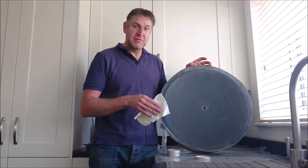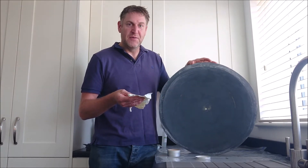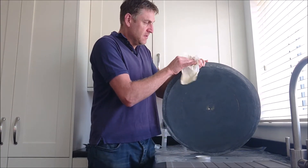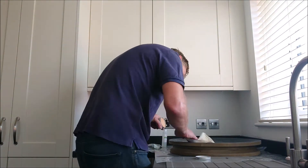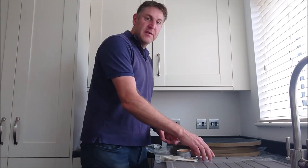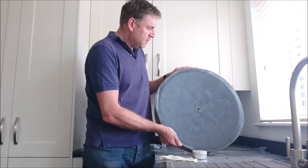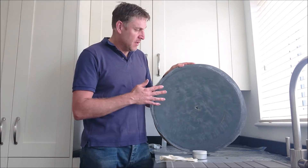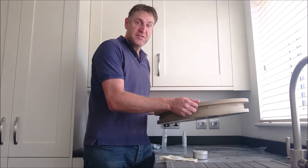After that we should be ready to put some epoxy in. So we'll just go through this process — I'll do some time-lapse videography so it's not too boring, so here goes. Right, that's done. So the mould now is completely covered in a thin film of wax. I'll leave that 15 minutes to dry and then I can polish it, repeat, and then ready for some carbon fibre after that which should be the fun bit. See you in a little while.